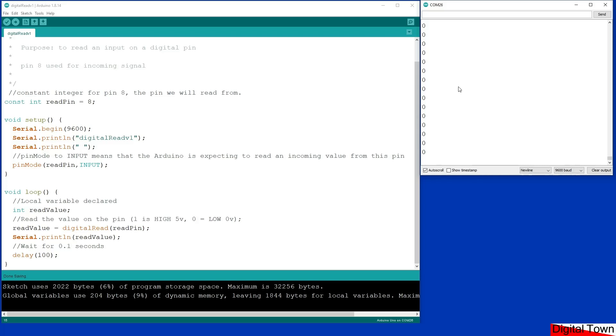What I want you to do is while the sketch is running, just put your hand near your Arduino. I'm moving my hand over and you notice the value changes — I hadn't even touched my Arduino, I've just put my hand near and I'm causing some interference. Sometimes if you make the delay very fast, down to 10 instead of 100, you'll actually see these values changing without you even going near it. The pin is experiencing interference, sometimes from the Arduino itself, sometimes from nearby components or electromagnetic interference. If you put your hand nearby, it could be capacitance.